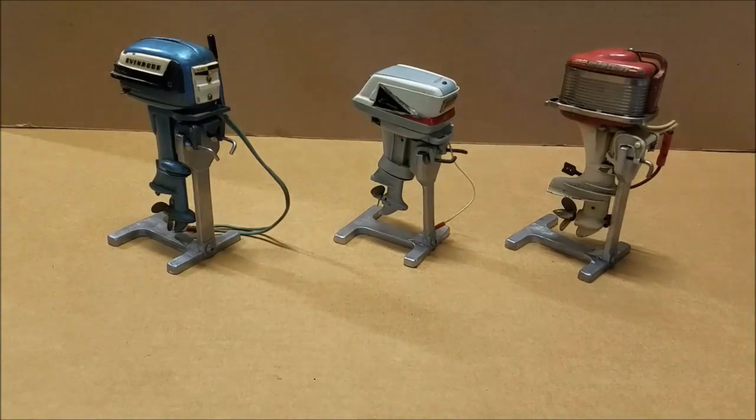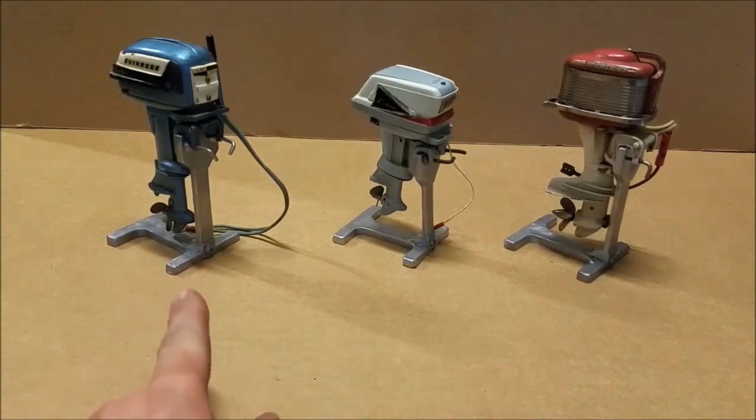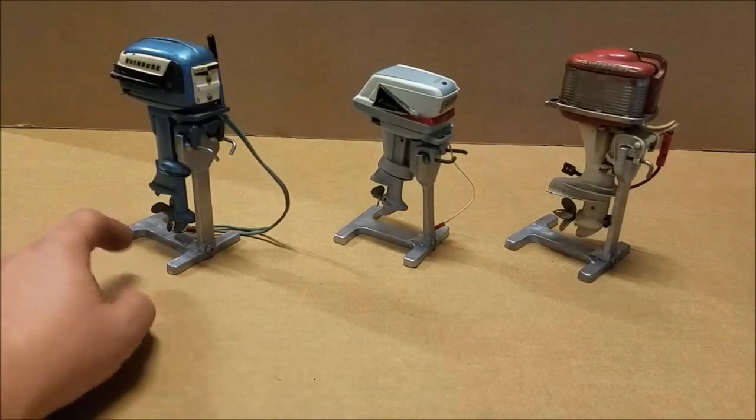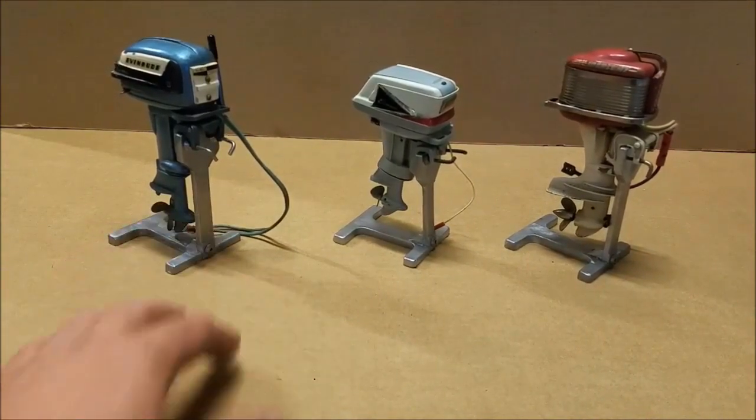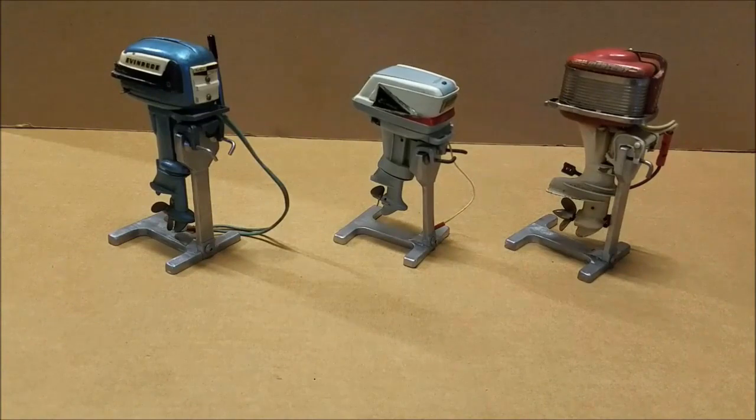So yeah, it's not as easy as you'd think. Even the second attempt, when I thought I had it down, it still took 4 or 5 tries before I got some usable parts out of it. And the other thing too, I don't think many of these parts came out of their own mold. Like, I think I had a functioning stand out of one pour and then a functioning stand out of the other, and eventually they all came together to make these 3 stands. Melting down outboard parts, however, no problem with that. You get good quality aluminum out of it.